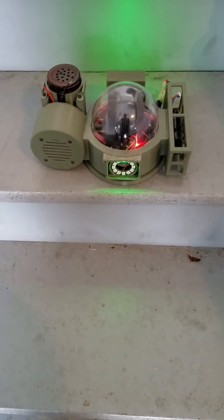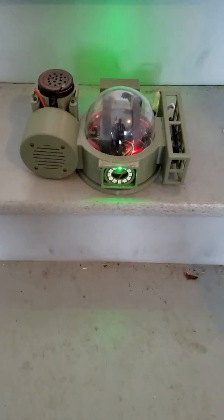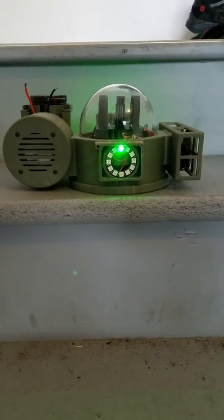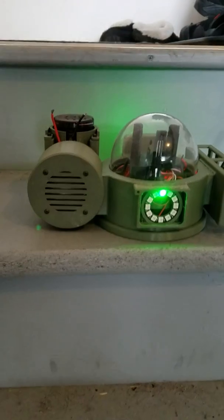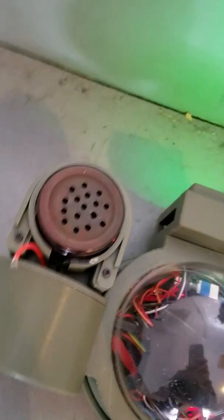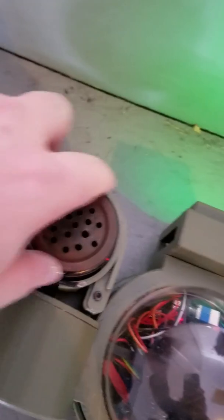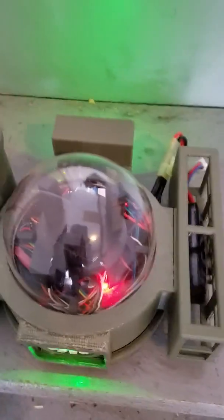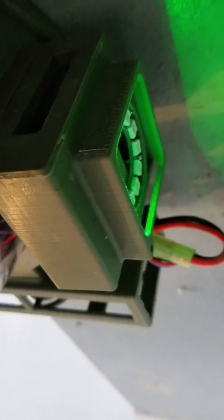Here is the infrared laser tag game I built for Pegasus Airsoft. Here is the IR receiver dome, with a speaker for sound, and this is where the smoke shell goes off — it sits in this glass pot here. It will short out with some nichrome wire and ignite a smoke puck. There are three infrared receivers in the dome, a battery holding spot, another LED in the back, along with the mount. It will mount to cars or buildings.